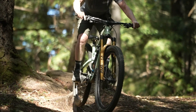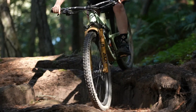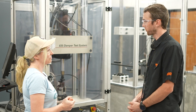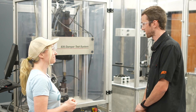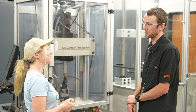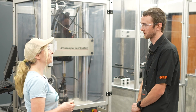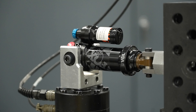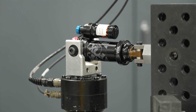From a test engineer's point of view, there's often the phrase: if you're not bottoming out, you're not using it properly. You do want to utilize the travel that you have. The reason a longer travel bike is more comfortable is because you're using that longer distance to slow the impact down. This machine was basically bending the shock — simulating non-ideal loads, like side loads that certain frames might put onto the shock — to make sure the shock can deal with that.